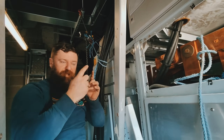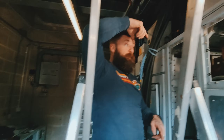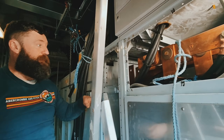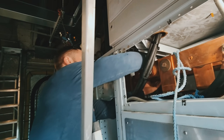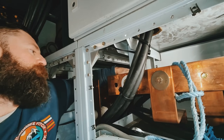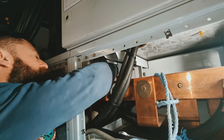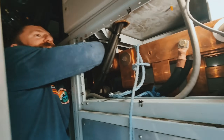Now what we've got to do is just do the neutral. We're only taking one bolt out because we're not taking the link out - the neutral is going to be supplied back over to the optimizer and then the neutral will flow through the rest of the hotel anyway. So we don't need to take the link out, which is lovely because that would mean taking another bolt out.